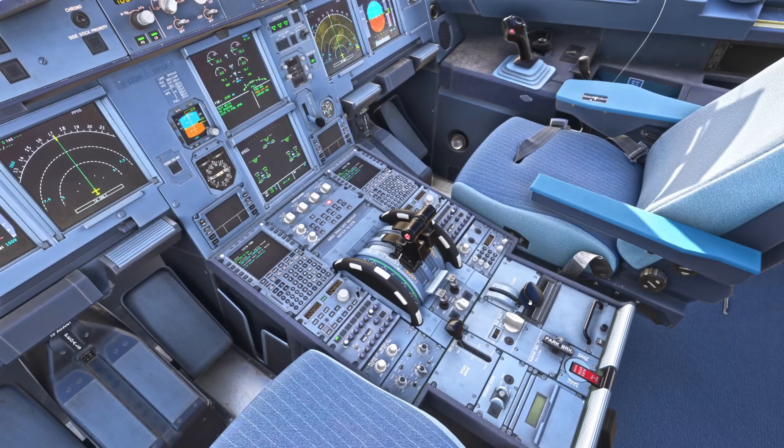We can now configure our flaps. If the temperature on the ground is plus 30 degrees Celsius, we want to leave flaps 1 out — I'll cover that in a separate video on hot weather operations. If we have snow or slush on the taxiway, I would leave flaps extended so we can conduct a check at the gate to ensure there's no ice stuck in the flap system before retracting them, as that can cause damage. Today none of those apply, so we select flap zero.